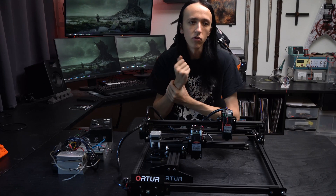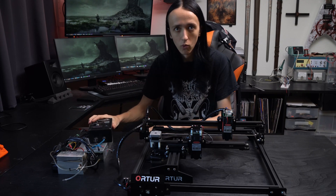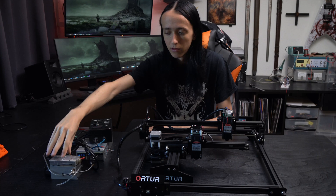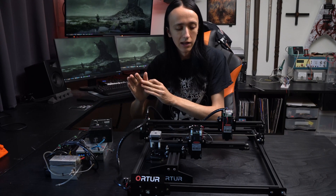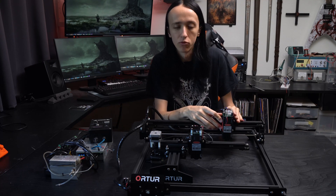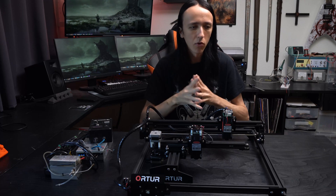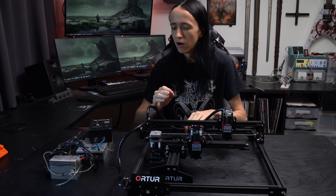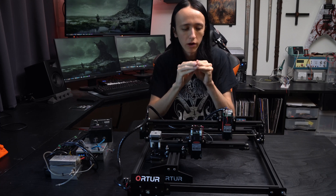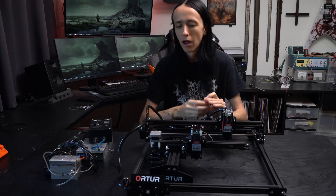If you want to get a really good diode laser engraving machine, I partnered up with Endurance - they are kind enough to sponsor this video - and I'm going to be installing their 10 watt plus laser. It's quite a powerful laser; the 10 watts here is the actual laser output, whereas even the 20 watt version on the Ortur is more around six or seven watts actual laser output. So there will be a laser output increase, but mainly the bigger interesting point is the laser beam quality improvement. On the Endurance 10 watt plus, the focus point is much more of a point, whereas on the Ortur the focus point is more of a line, so cutting plywood and similar operations will be a lot easier.